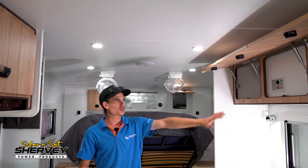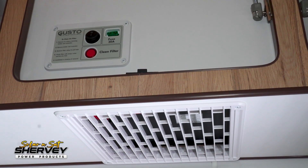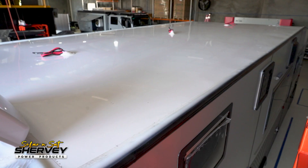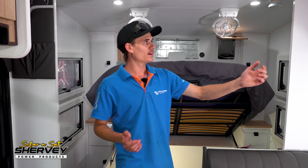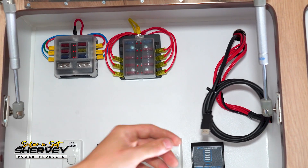Having a split system also gives us more room on the roof for solar. They've also got a Gusto DRS vent so when the customer goes off-road he still has the DRS vent without it taking up roof space — again, more room for solar. Literally the only thing on the roof is a roof hatch for the shower. So we're going to see how much solar we can fit up there — the plan is around 2,200 watts, which will make for an extremely impressive system. In the overhead cupboard they've run HDMI leads and 12-volt cables so we don't have to.